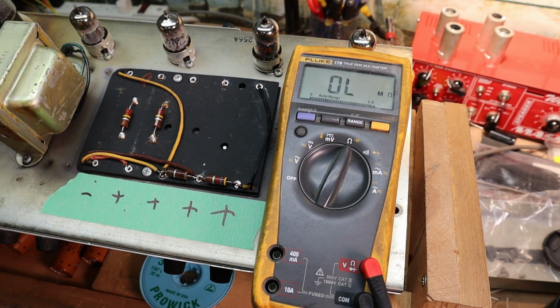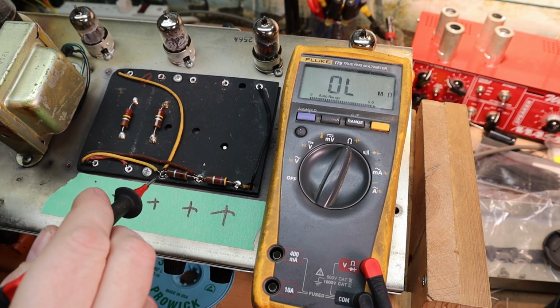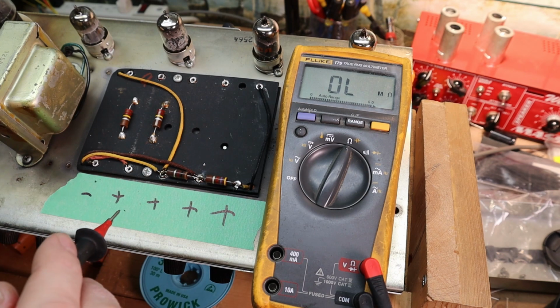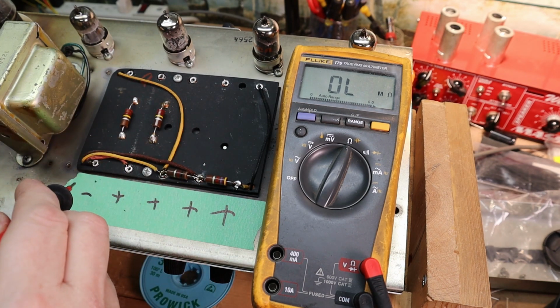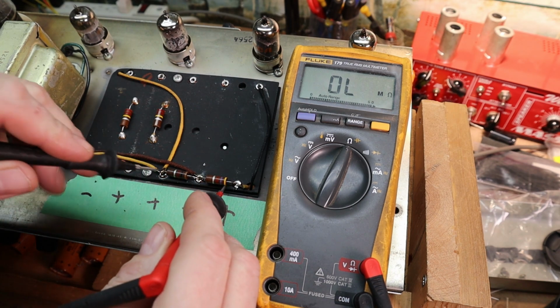All right, we have the power supply board all cleaned up and ready for new caps. I'm gonna go ahead and check the resistors, make sure they're within tolerance. There's something I noticed on this one. This is when they're transitioning in the blackface from the blonde amps. The AA763 schematic does not have bleeder resistors between the first two caps. The AB763, which is your standard blackface schematic, does. So if you look at the tube chart, this does say AA763, and it's a blonde, but it actually has some of the blackface modifications that were done. So, very interesting.